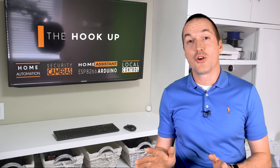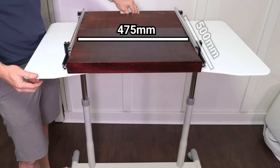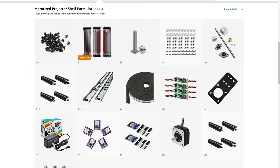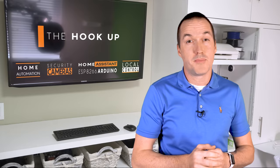In this video I'm specifically going to show the measurements for building a shelf that's 475mm wide, 500mm deep, with 380mm of motorized extension. I've made an Amazon page that has all the exact parts I used for this size, but it's pretty easy to adjust the dimensions to use a different length of drawer slide if the shelf is too big or too small for your location. These Amazon listings go out of stock all the time, but the parts are super generic, so don't be afraid to order from a different listing to get a better price or faster shipping.